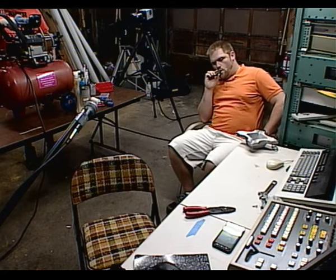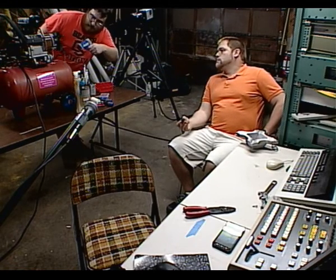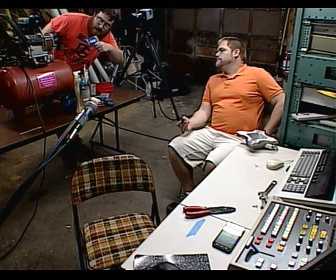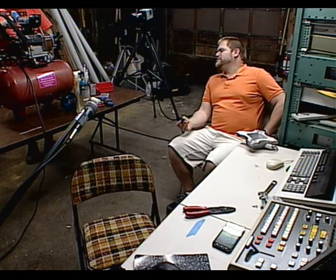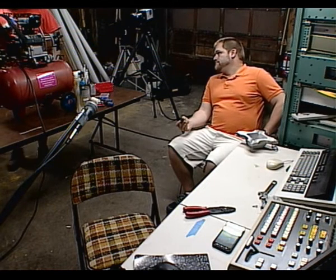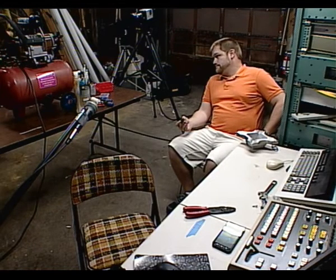Let's see. Got about 80 degrees on that cap. That one's similar. Yeah, well, it's about 80 degrees in here, so that's not... Yeah, and the motor windings are about 88. Body, let's check the head here. 150 on the head. Yeah, I believe that. Little toasty? Yeah, a little toasty. It needs that fan shroud.